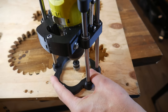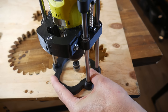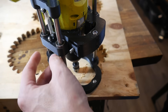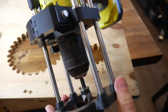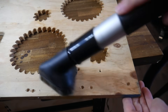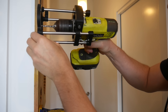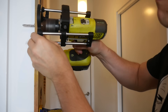The main feature I really wanted is the depth stop — here's how to use it. Typically, like a drill press, you would do your first bit of countersinking without any depth stop engaged. When you're done, with the drill turned off, you can lower down the countersink bit until it touches and lock the clamp in place. That means any follow-up holes should go to the same depth. We vacuum up the debris and we can see our two holes are as close to identical as you can get. The beauty of this compared to a drill press is it's completely portable — you can use it upside down, sideways, wherever you need to.